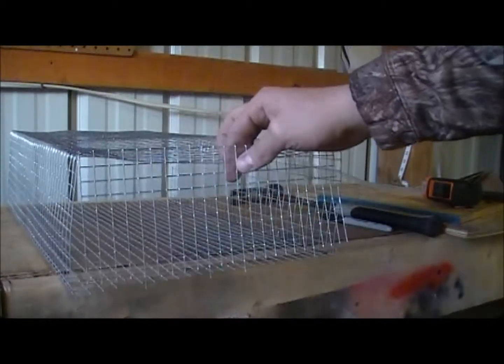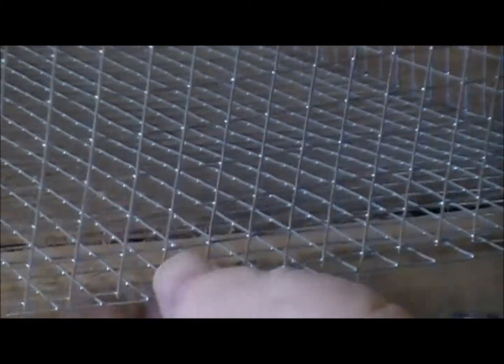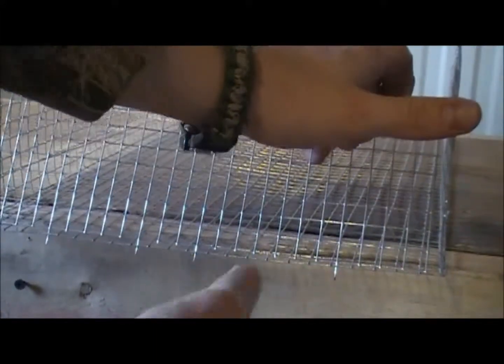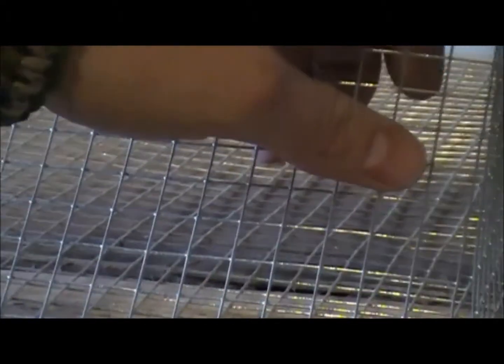So we cut that. Now we're going to come in here to this corner — let me zoom in — find one of my tabs, right there. We want to set this down in like that. You see how that sits and it doesn't go the entire way down — it sits up a little bit there. That's because these pieces are bent, and what we're going to do is we're going to actually take that tab and bend it up and over.